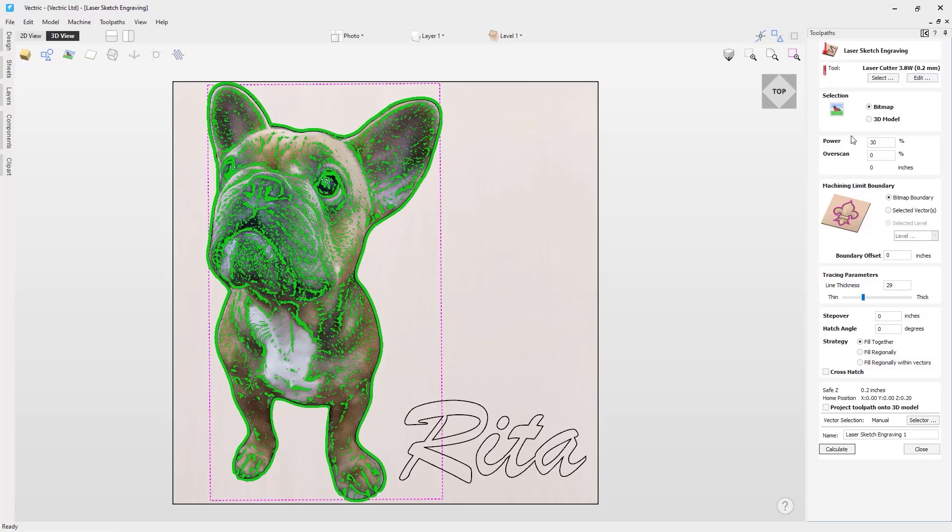The next two options are the power - this is the percentage of the laser power we will be using - and the over scan option. The over scan option allows you to have the laser move past the edge of the lasered area. This will turn the laser off at the edge but allow the machine to continue moving. You can use this if you are seeing a darker edge to the laser burn due to machine deceleration. This is machine dependent and I would recommend running tests to know how much over scan you will need.